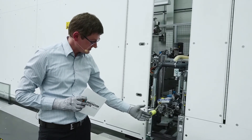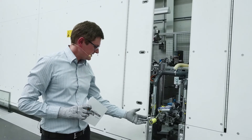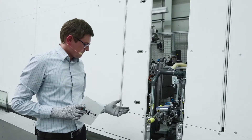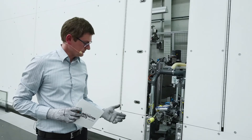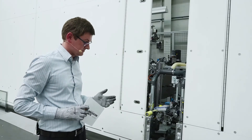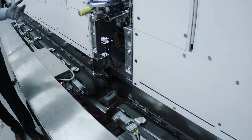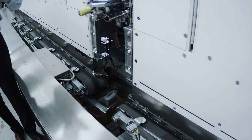The roller has a structured surface to reduce the sticking of sealant on the roller as much as possible. In our development we tested many different kinds of rollers, and finding the right material is a much greater challenge than it seems. For the process it is also important for the roller to be wet over the complete surface, and for this task we have an integrated spraying device. It is hidden under the conveyor belt and automatically swivels in for the humidifying process. After each run the roller gets into the station where it is moistened evenly and prepared for the next refining process for the next IG unit.